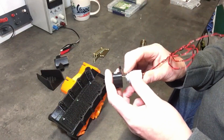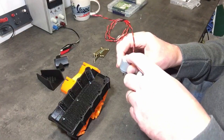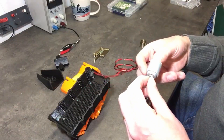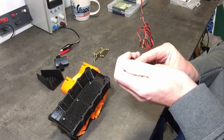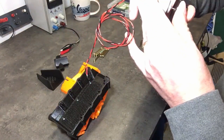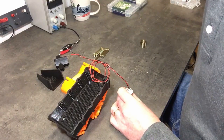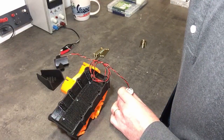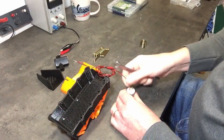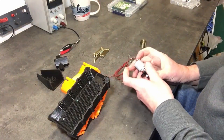It's designed for a very small DC motor like this, with a 2 millimeter axis. Be careful when you push — if you push on the housing of the motor you'll squeeze the commutators. You have to make sure you're pushing on the axis. Push on the axis from the top to seat it properly, rather than on the housing.